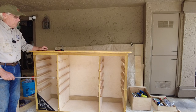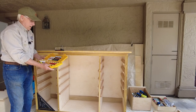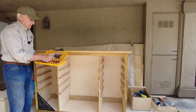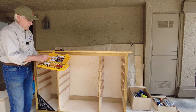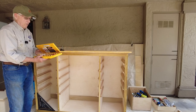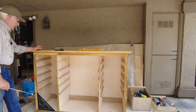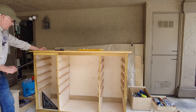Is there a solution? I think yes. Matt Jackson of Next Level Carpenter taught me about these — a set of wax tints you can use at the end of a project. If you have a little color mismatch, you find the right color and apply the wax. I haven't done it yet because the instructions say to do it after all your finishes are on. This is from Fast Cap — it's called the Soft Wax Kit. I'll try to remember to put a link below, or you can go to the Fast Cap website to get it.